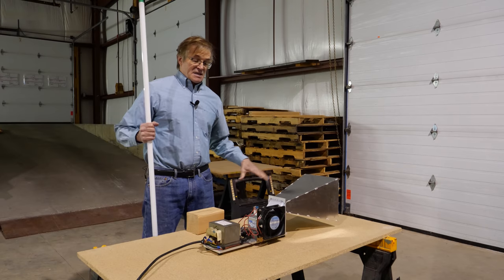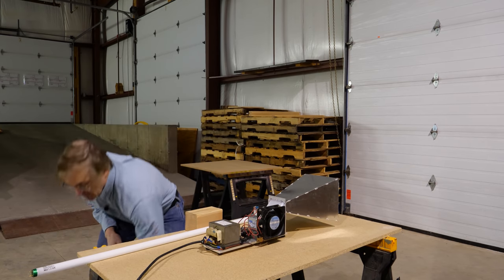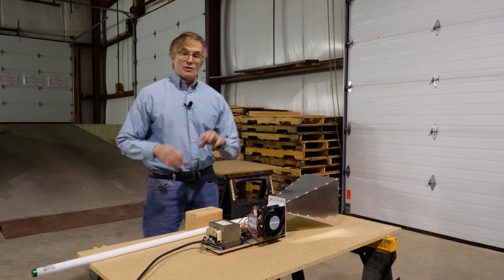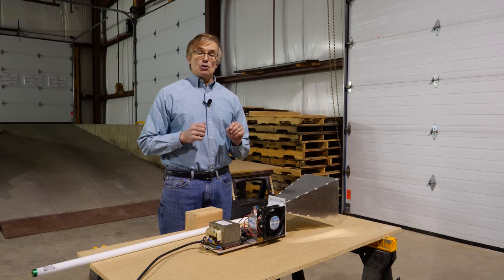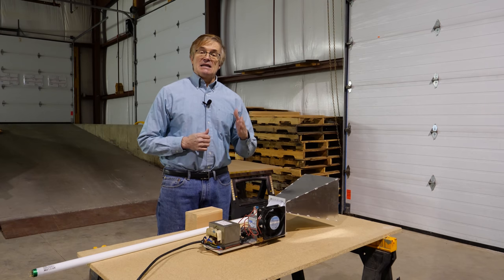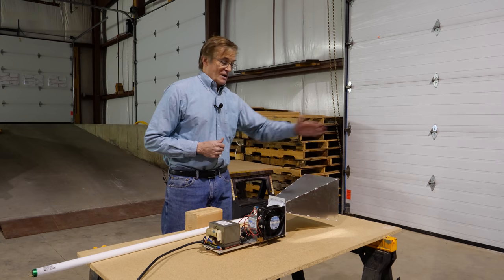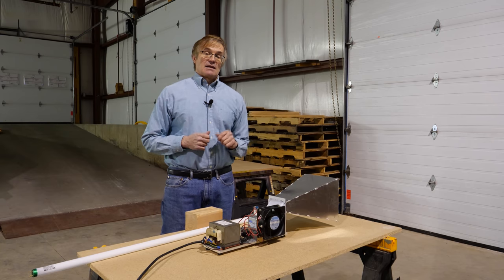The reason none of these materials block the microwaves is because, other than the example with water, which has a polar molecule that can flip back and forth and convert the energy into heat, none of these other materials include any kind of free polar molecules that can interact with the beam. And because they are not electrically conductive, they will not reflect the beam either. It will transmit right through them. So what happens if we get something that is electrically conductive?